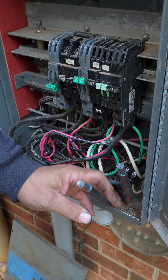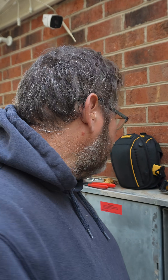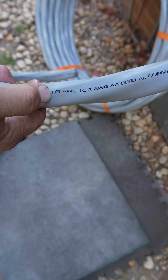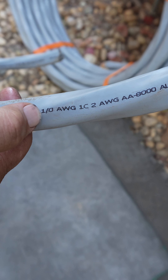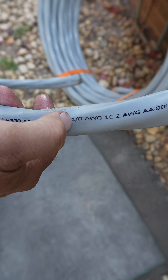But that doesn't solve our issue here. I went from a 100 amp sub panel and switched it because I realized I wasn't going to have enough breaker space, so I upped it to 125. I'd already run this 1/0 wire — not to be confused with a one gauge wire, this is a 1/0. See that forward slash? And this is a 2/0.